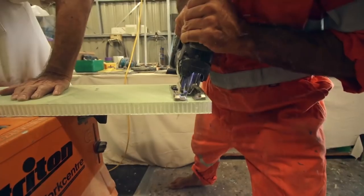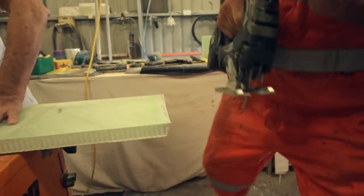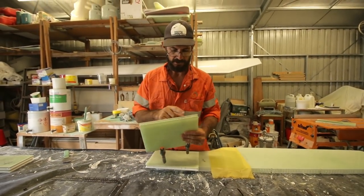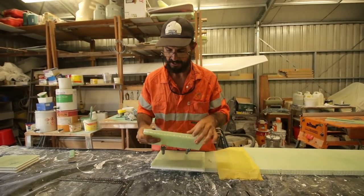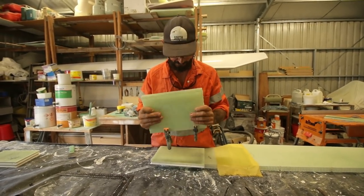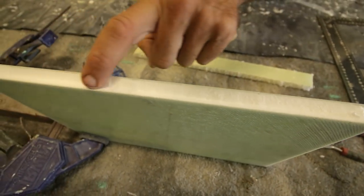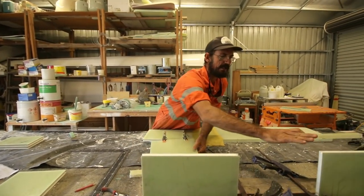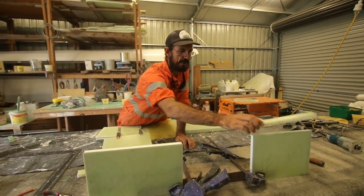Not only did we have to get the length of the seats right, but the ends had to be cut on an angle to match the shape of the sides of our dinghy. Once this polycore has been glassed and you're ready to treat the edges, David likes to route out the core back to the fiberglass, which leaves you with this edge. He fills it with resin, then once that's set, puts bog in there with forms so they're nice and smooth, giving a really nice smooth finish.